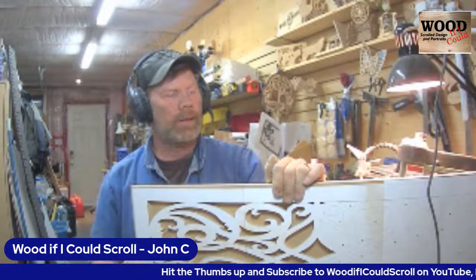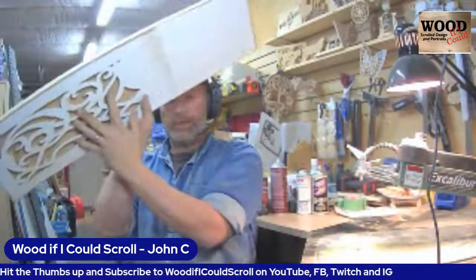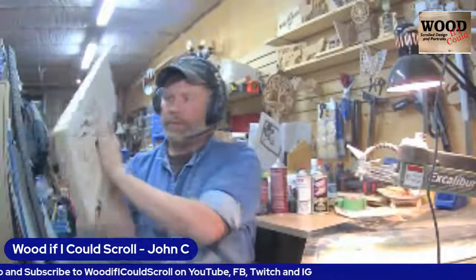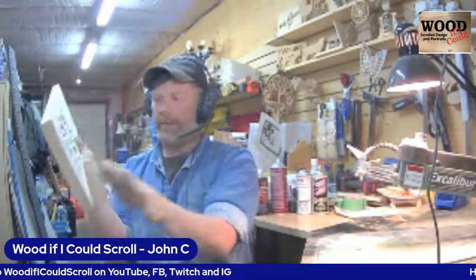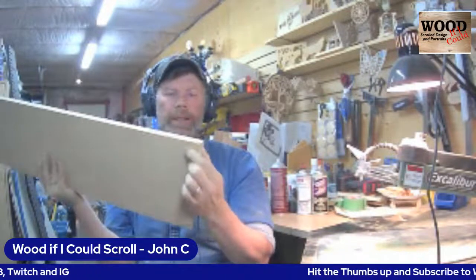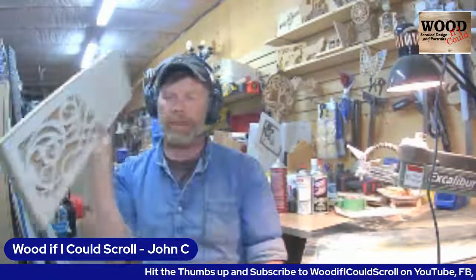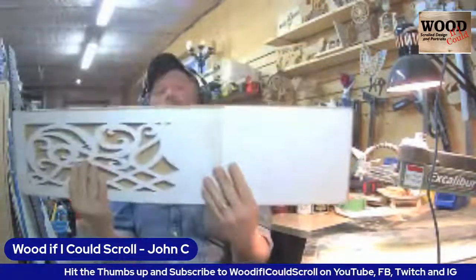And so what I'm thinking as well, because the holes in the front are so big, the tortoises when they're in the hallway might drop something down the holes. So I'll probably just router cut a rabbit in the backside, and just put a screen in the backside of it as well. So that'll look kind of cool when it's done. Yeah, absolutely.